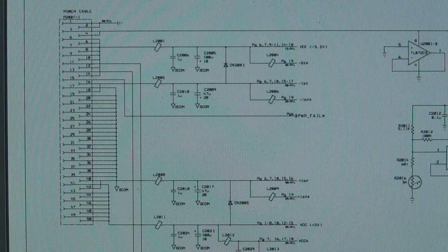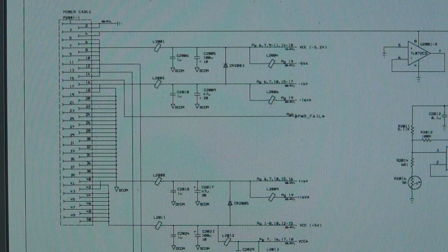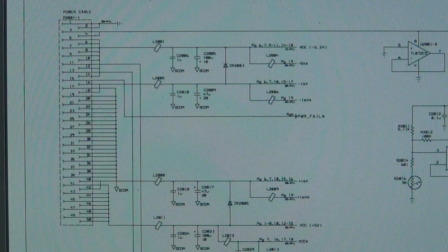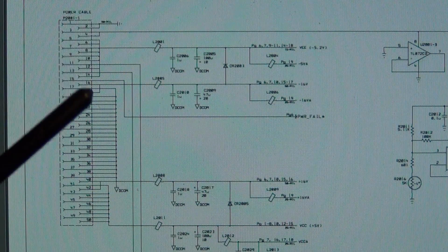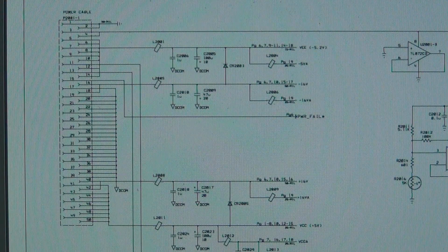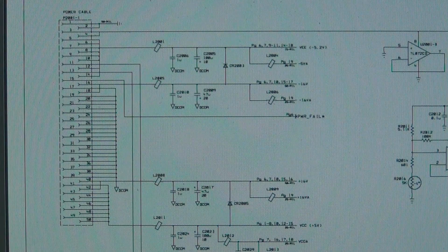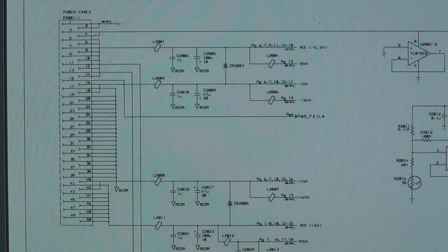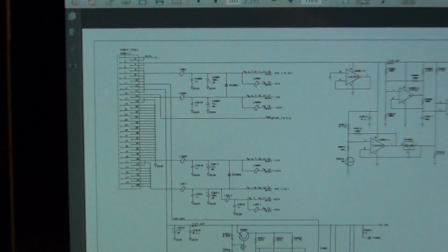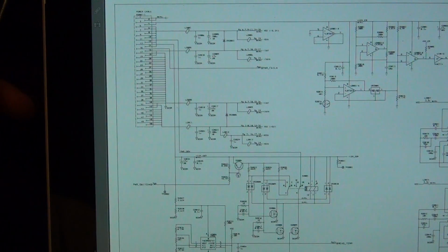What usually happens in soft switches is that a portion of the power supply obviously needs to be on, because there's a portion of it that needs to provide some level of power back onto the main motherboard in order for that switch to be active and so that there'll be a way for them to actually detect a soft button press. Now that's not always the most power efficient way, because it means that when you plug in the instrument, part of it is always going to be on and burning electricity, and you want to minimize that as much as possible.